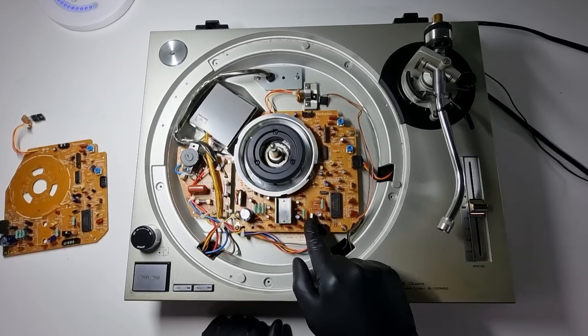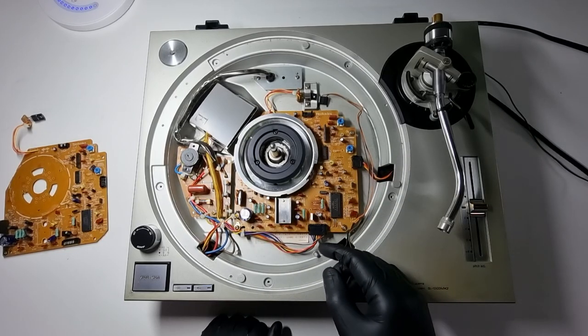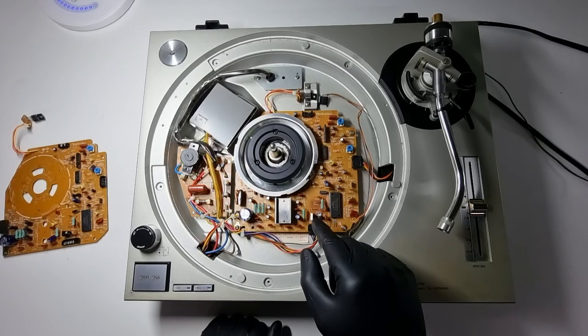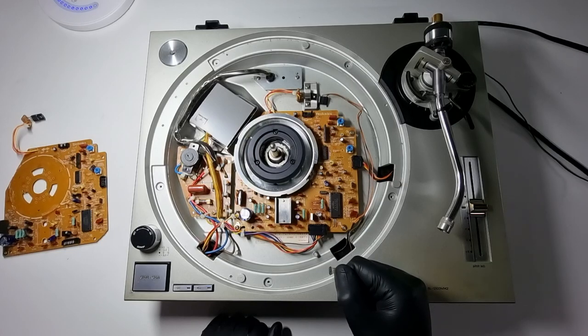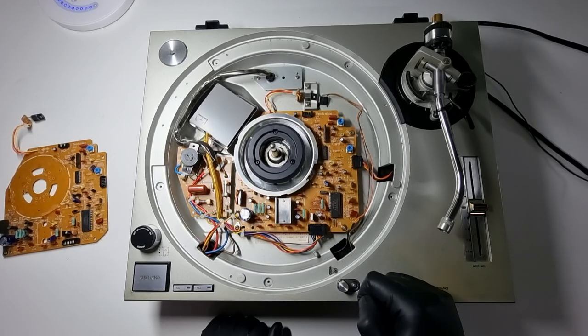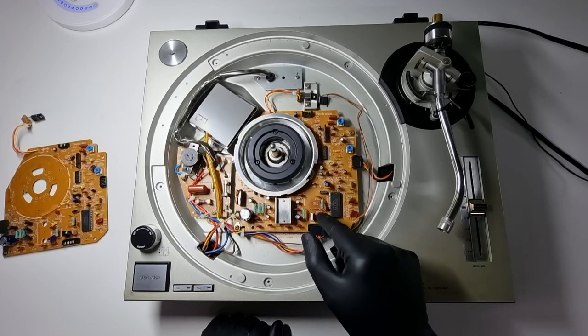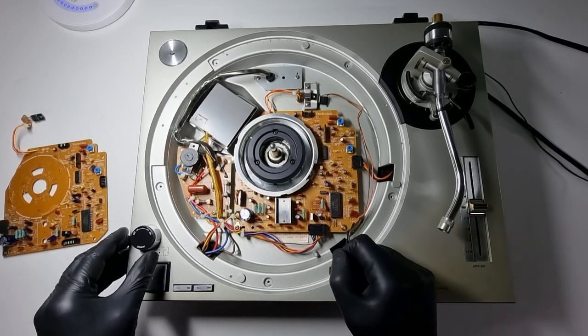If you give this to somebody and they're dishonest, they can turn around and say that this, that and the other needs replacing, baffle you with science, when actually all it required was either a replacement transistor or re-soldering back onto the board, having the old solder removed, having it reflowed, and having fresh solder popped into place, and that will solve your problem. Now, there may be other issues around this section of the board as well that I need to check over, but that issue there is the main root cause of that problem.